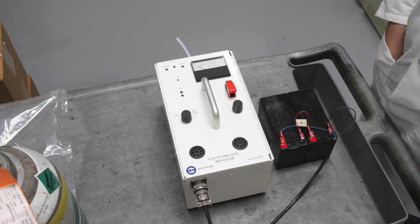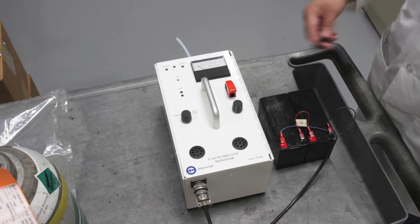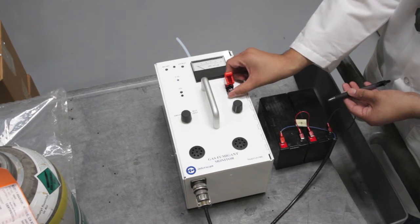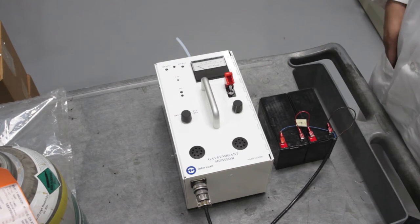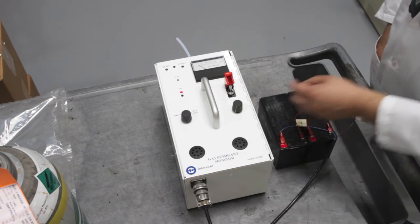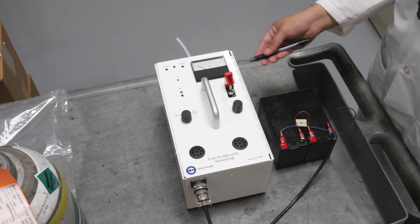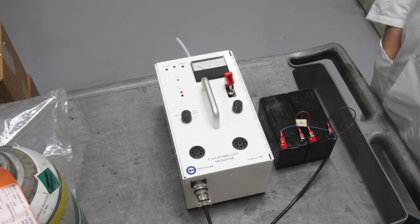To prolong the life of the furnace during the stabilization period, turn the furnace off. This is done by putting the switch in the up position. In some cases, the monitor will indicate an upscale reading when powered on and drift downward while the monitor warms up. Upscale readings can exceed the full scale and do not necessarily mean there is a malfunction.